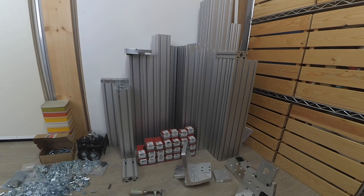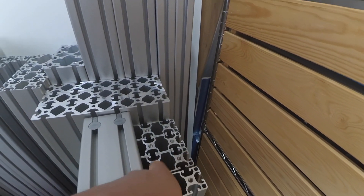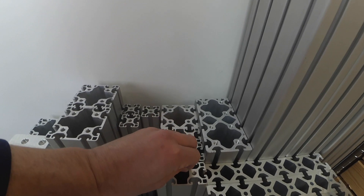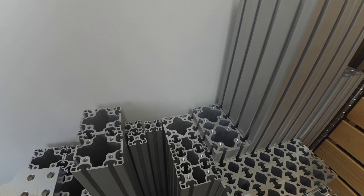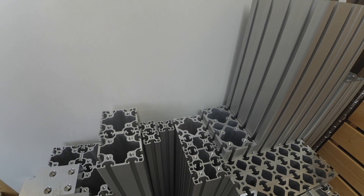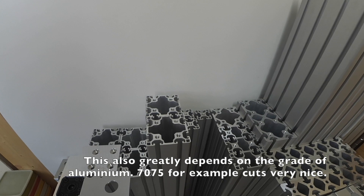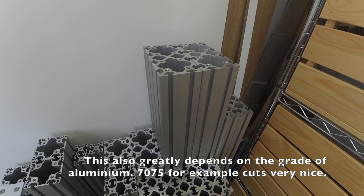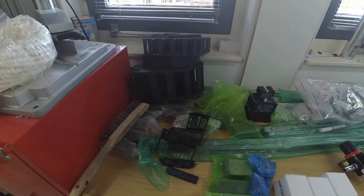I've got a few holes to drill, and luckily I already threaded all the needed parts. By the way, when threading aluminum with a tap, I always reach for lithium grease — the yellowish grease. Normal aluminum tends to gum up when you reverse and back the cutter out of the thread. With smaller M3 taps I always used to break taps when backing out, but with lithium grease it never happened again.